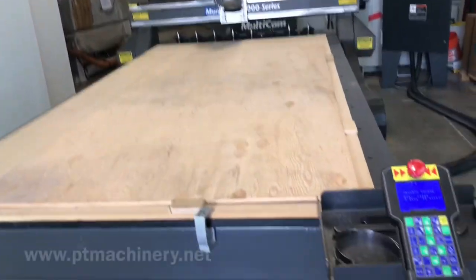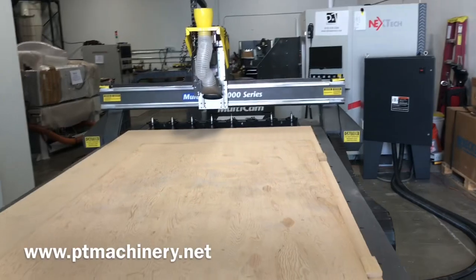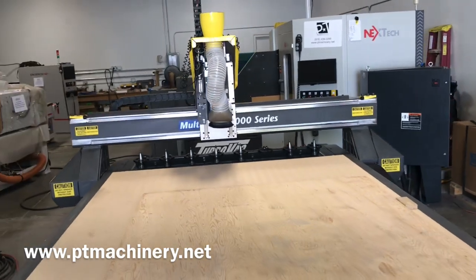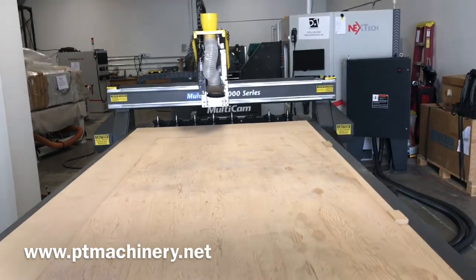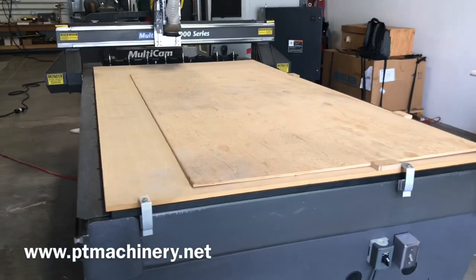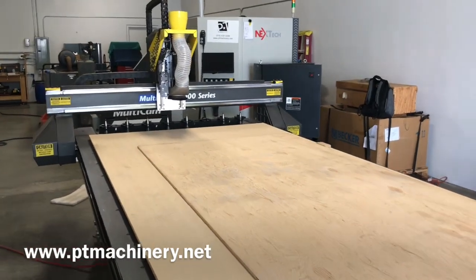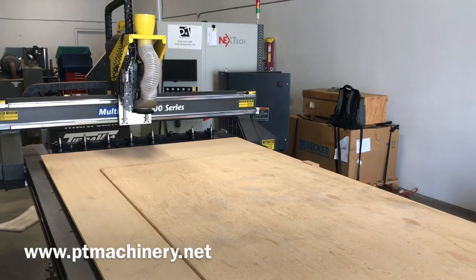The machine is now up to 18,000 RPM as you can see on the keypad, and it is still super smooth — no vibration. You can hardly hear that spindle. That's part of the safety feature of why we warm up in the back middle, so it's hard to reach and hard to touch. Because in a busy shop with other machines going, you really would not hear that spindle at all — it's that quiet. That's built into the controller and part of the programming to try to eliminate any safety issues of the spindle being easily accessible during warm-up.